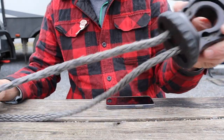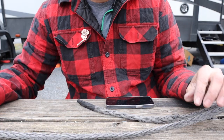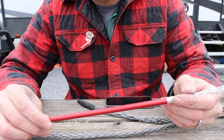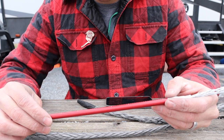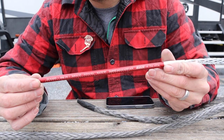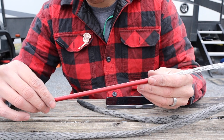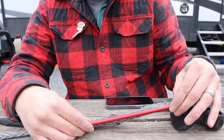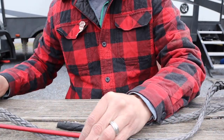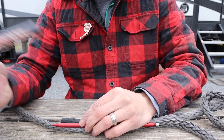Now that we have it through the thimble, we've got a length here. Next thing you want to do is actually mark the winch line for how deep we're going to be burying this. It's recommending at the max on the three-eighths inch is 27 inches. So what I'm going to do is just do four lengths of my FID approximately, which should get us closer to 28 inches. Again, I don't believe more is a bad thing. So I'm going to do that now, then we'll mark the line — that'll tell me how far down we're going to bury this thing and where our exit point is going to be. One, two, three, four — that should be plenty deep enough right here.